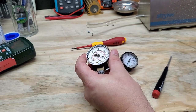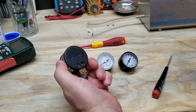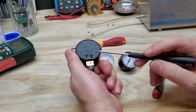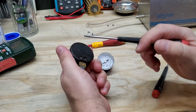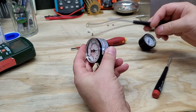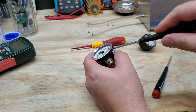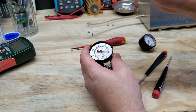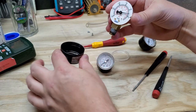And what do you do with that old one? Well, if you're me, you're going to make videos. Almost all gauges have pretty similar anatomy when it comes to taking them apart. There are fasteners on the back — you can see them right here. Once you take out the two fasteners, that pretty much loosens the internals from the outer casing. And once you take those two out, there should be a little notch, which this one has right here. Take a little flathead screwdriver, pop it in there, and take off the face of the gauge. Then the internals come right out.